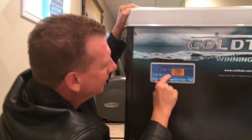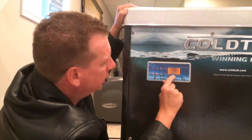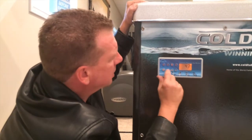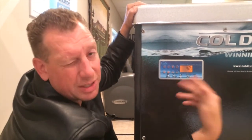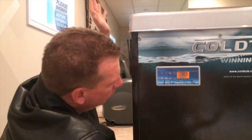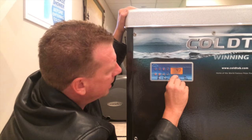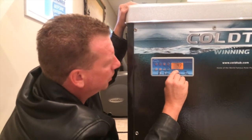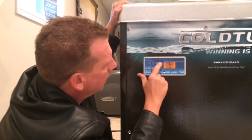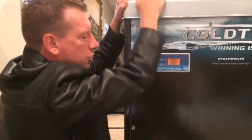Set the temperature down to 42. The triangle symbol is for your chiller — that's the icon that turns on when the chiller is activated. It's set for 42 but it's at 43 — it has to do a 2-degree differential before it allows the chiller to turn on. And the light icon comes on when the light is running. That pretty much explains the topside controls.